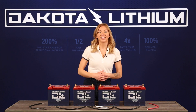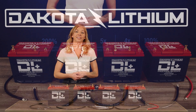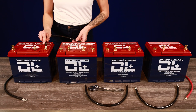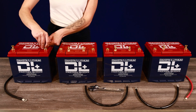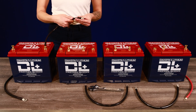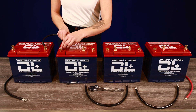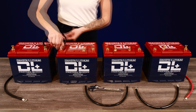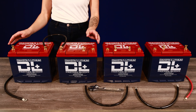To wire the batteries together, remove the terminal bolts from each battery and set them aside. Connect one end of a cable to the positive terminal and reinstall the terminal bolt. Take the same wire, now attached to the first battery, and attach the other end to the negative terminal on battery two. Replace the terminal bolt for the negative end. These two batteries now make a 24 volt bank.